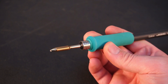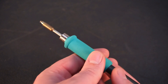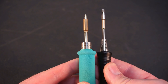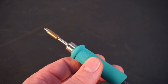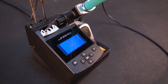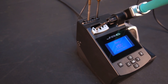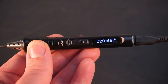The grip-to-tip distance is impressively short, and despite this, for the entire time I've been using the station I've never felt the handpiece heat up. Even when compared to the TS80P, the JBC has a much shorter grip-to-tip distance. Maximum power output from the JBC is a mind-numbing 130 watts, so it's hardly fair to compare this iron to the TS80P which is a humble 30 watts, but we have to have something to compare against.